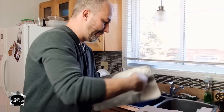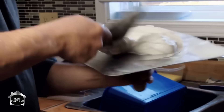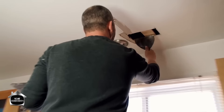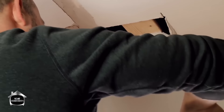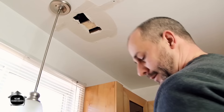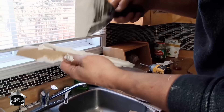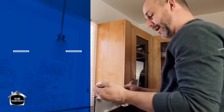It's important to work the mud before you apply it — just work it up a little bit, it loosens up. You can also add just a little touch of water to make it a bit wetter and ensure a good bond with the paper so you don't get air bubbles you'll have to repair later. Apply the mud to the ceiling around the patch and add some to the crack so it has something to bond to. Put a little mud along the outside perimeter of the patch for a really good bond. Because we have blocking in the wall, once I put this up I'm also going to attach it with a screw.